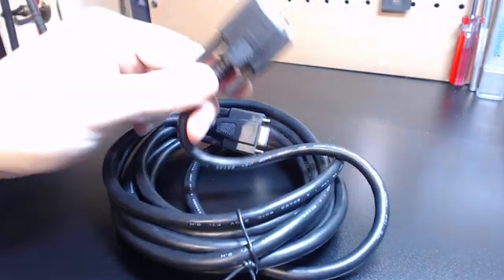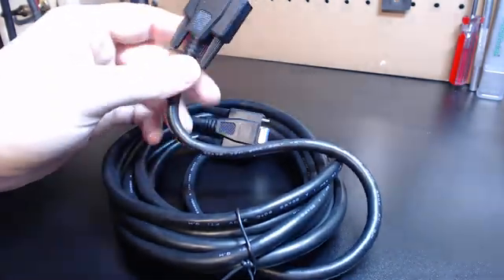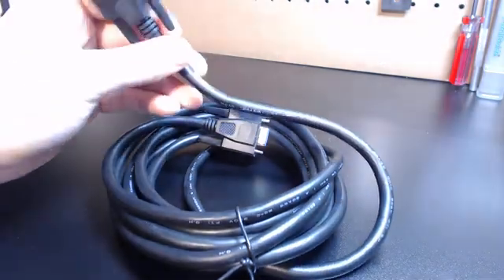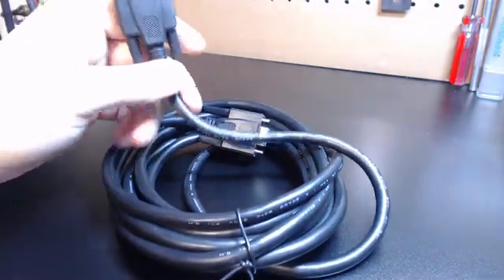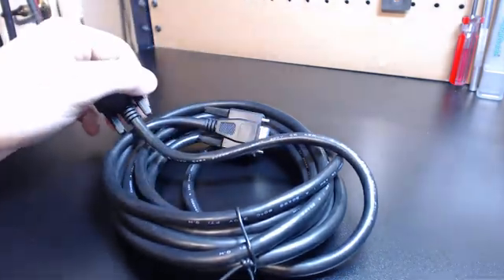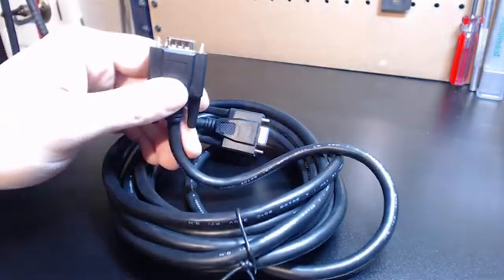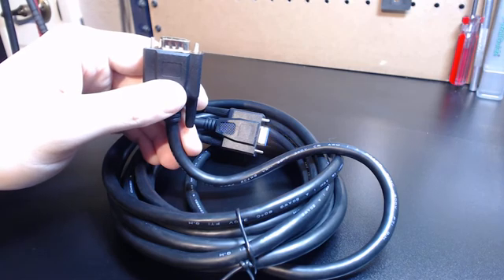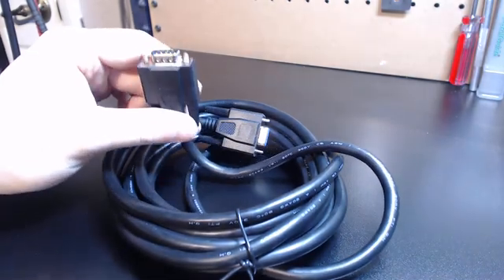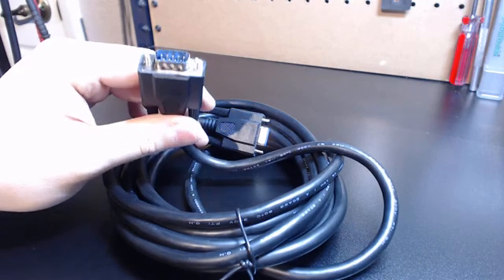I decided to go with an actual signal cable, and for those of you who don't know what that is, it's used in the industrial industry usually for automation — a very, very flexible type cabling. Going with 20 AWG and a molded cable, I wanted to make it a universal cable. A lot of cables out there actually have a resistor built into the cable that only supports a certain type of motor. I did not want to do that. I wanted to make a universal cable that you, the end user, could support with the G540 on any motor available for your particular application.